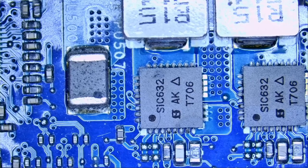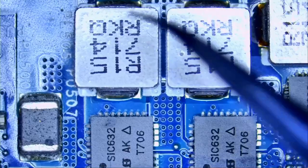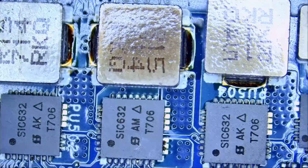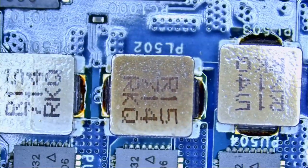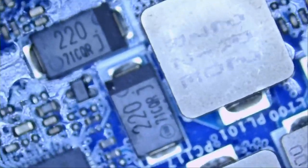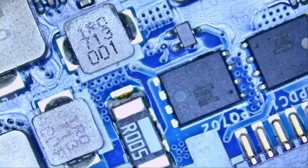I have many videos working on Dell Alienwares — you can go back and see me do exactly the same thing. Let's hope this one is different. Look at the inductors on top — they look clean, but one of them looks dark, and most likely we have a problem with the DR MOSFET under it. A dark inductor doesn't mean the MOSFET is bad, but it's a good indication. What we're going to do is inject voltage at the drain of the MOSFET where we measured a short, then inspect the motherboard under a thermal camera to see what gets hot and pinpoint the short.